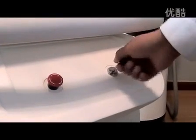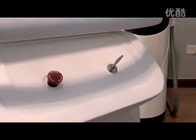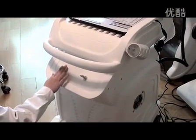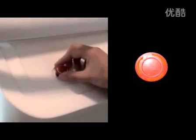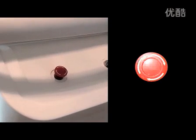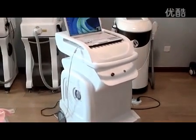Debugging. Turn the key in a clockwise direction to launch the machine. If the machine failed to launch, please rotate the emergency switch in a clockwise direction and keep it in bounce status. Keep warming up the machine 3 to 5 minutes.